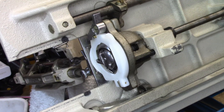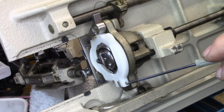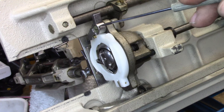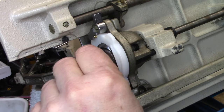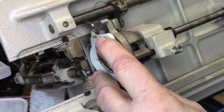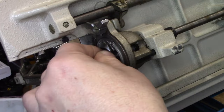The model 237 uses this plastic cover for the shuttle assembly. It's hinged here and released with this lever, which forms like a gate. I'm going to go ahead and pull the bobbin case out of the machine — there, it's removed. You simply release this tab and then this all swings down, allowing you to remove the shuttle from the machine.